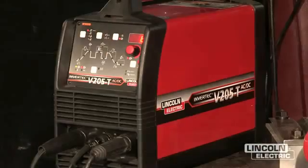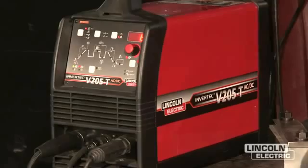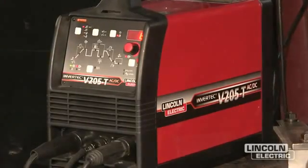You can see that I've got my favorite machine here. The reason it's become my favorite machine is over the years I've had to travel throughout the country, mostly at the racetracks, sometimes the airfields, and I don't necessarily have 220 or 208 power. So it's always a surprise — if I only have 115, that's what I use this machine for. You can see this is portable. It goes up to 205 amps, AC-DC, and it just runs a great arc.